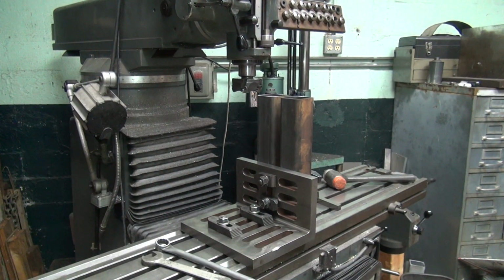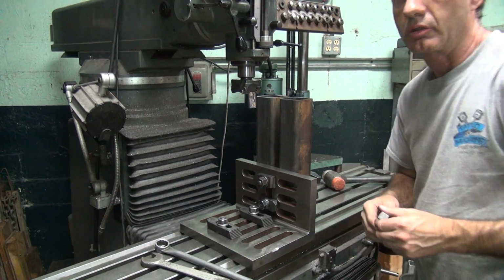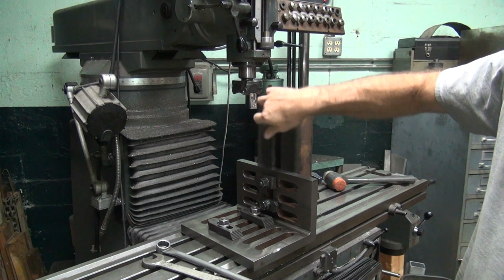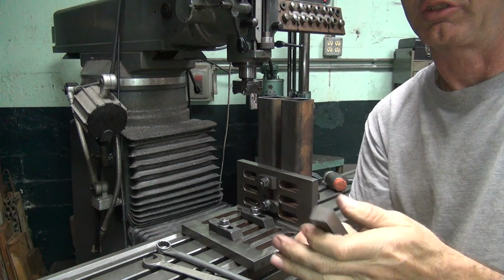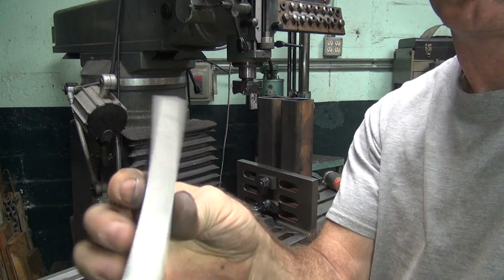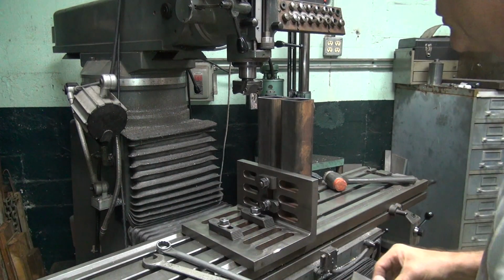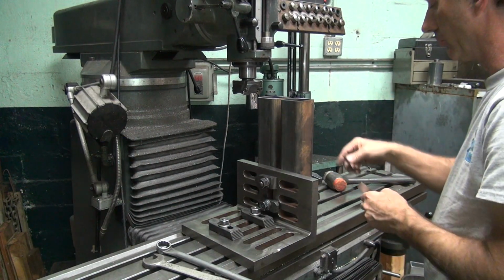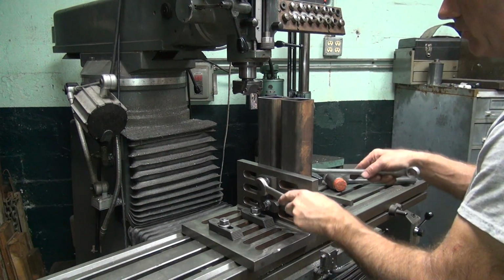All right, I just did this here and they're not square. I'm in about 50 thou error between the gap here and the gap down here. They're in slightly like this. So maybe I'm going to take a solid piece of parallel, big tool bit, 5/8. I'm going to put that in between the two, clamp them together, and that'll square them up. Then I can cut them and flip them and do it like I should. So if one way don't work, try something different.